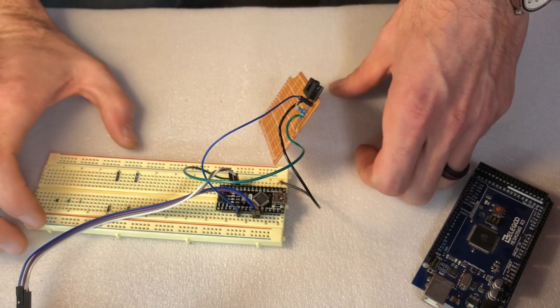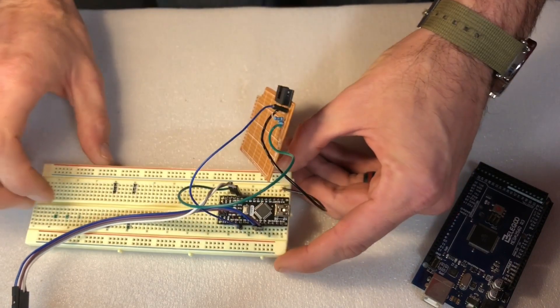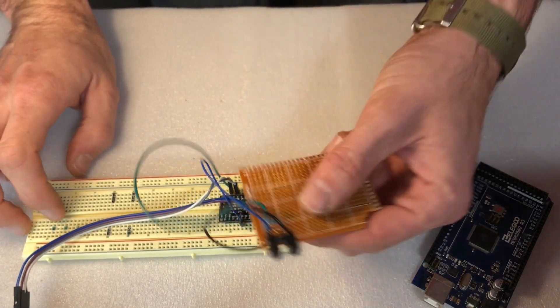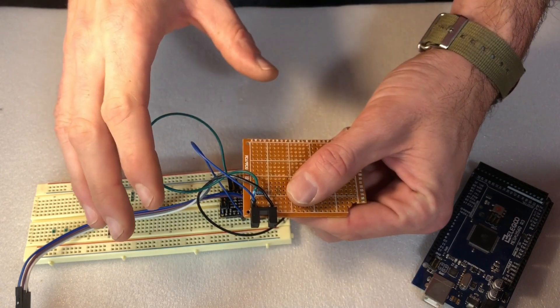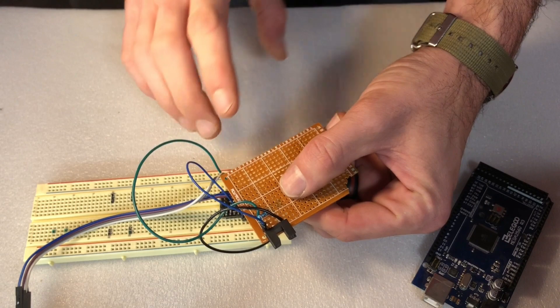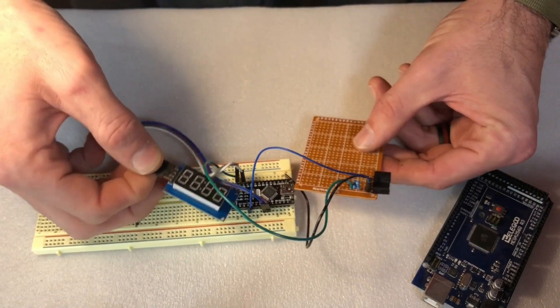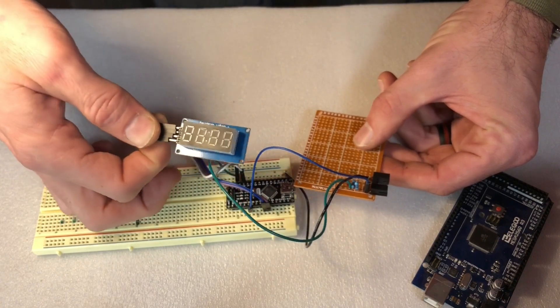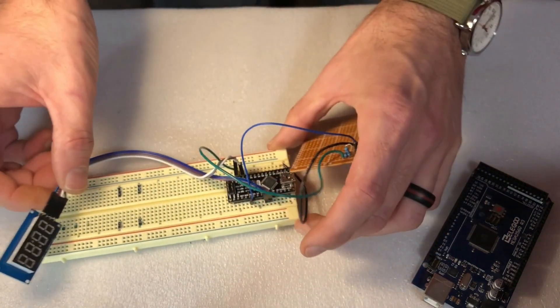Here are all the ports we're using for the counter. We've got a nano board right here, and we've got an opto interrupter switch — very simple to solder up, very simple to build. It's basically the switch and two resistors. We've also got a TM1637 digital display and it's very easy to hook up to the board itself.